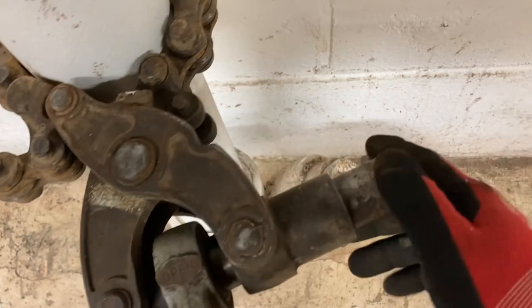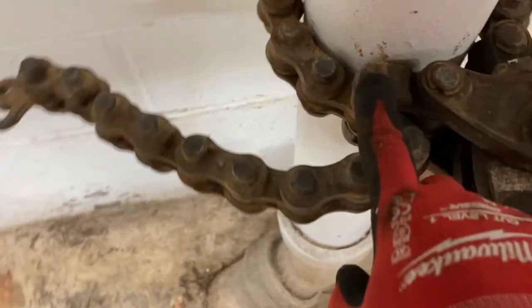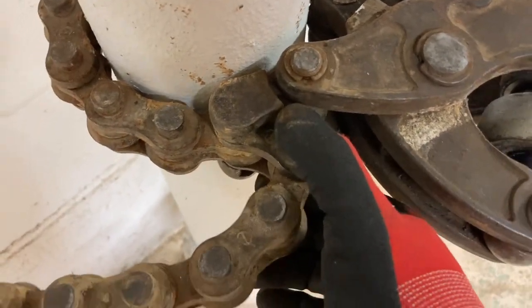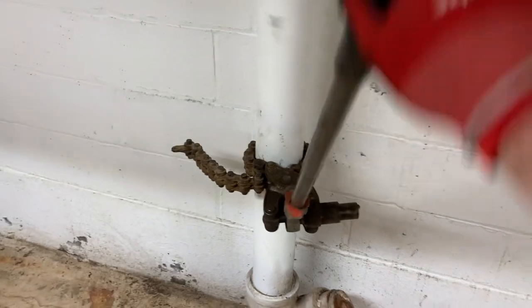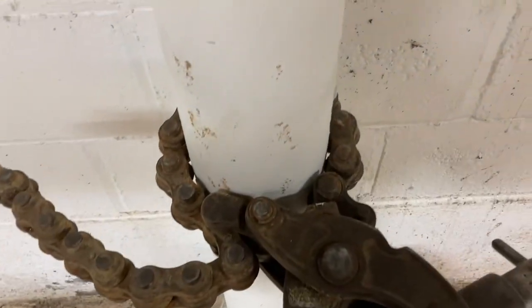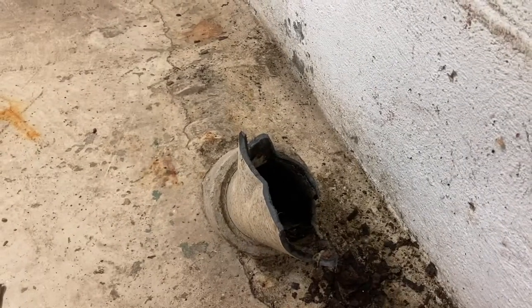The tool is fastened to the pipe. Rotate this lever so that it's able to freewheel. Once you have it snug, these female doodads engage with the teeth on the chain. Then turn it so the arrow faces cut, and this huge handle is basically just a big ratchet — just keep pushing it down. It'll squeeze these jaws together and cut the pipe. A little help from the sledgehammer to bust this up — that's a nice, relatively flush cut, so that's perfect for attaching a fernco to, which is what we're going to do.